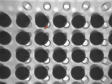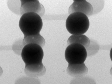I've got another image here which shows solder balls which are misaligned with the pads and the paste on the board side. So ideally these pads should be directly in the middle of these balls, but on this image you can see that they're slightly above and slightly to the side. And also here we've got 4 solder balls. 3 of them have appeared to have formed solder joints with the bottom side, but there's one in particular which hasn't, and that's essentially forming an open joint.